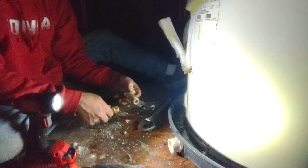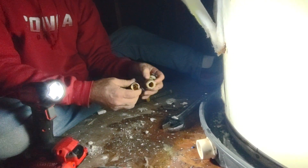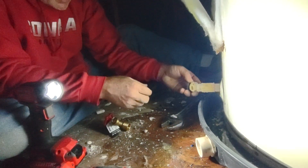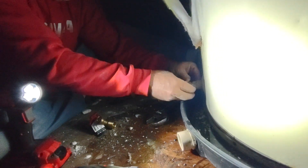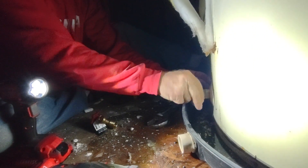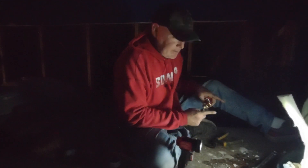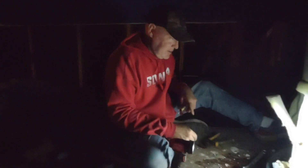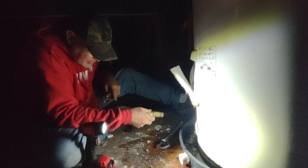We need a brass nipple to go in there and stub out. I'm gonna put this one back in temporarily — just get it so it doesn't keep leaking; there's still a little bit of water in there. This is just gonna be finger tight, basically serving as a plug now. The hardware store might close at six, so I'm gonna run back over there. You should probably bring that fitting with you. You're right, son — I should just take it with me. You can plug it with a napkin; see how it's just gonna keep draining water — that's what I don't want.